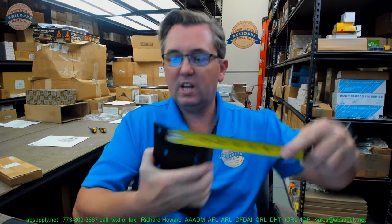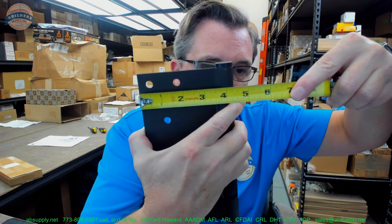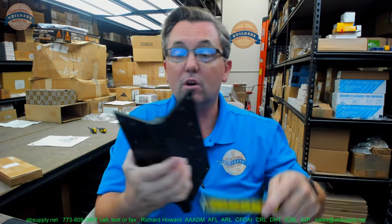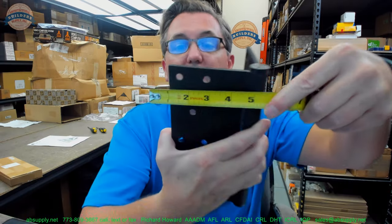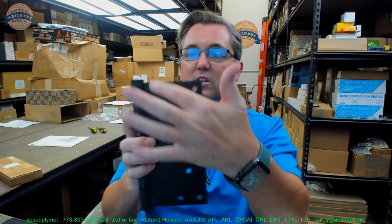Where you're going to use this hinge is probably something that's thick to begin with. Just putting a tape measure on the hinge, you're going to be at a 2.5-inch or 3-inch thick door. What would be the widest you could go? Probably 3.5 inch in terms of fitting the hinge leaf. You could go with a 6-inch thick door, but you're just going to have a lot of that hinge not mortised into the edge of the door. When we look at the template, we'll talk about the leaf width.